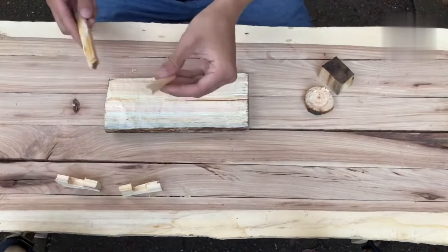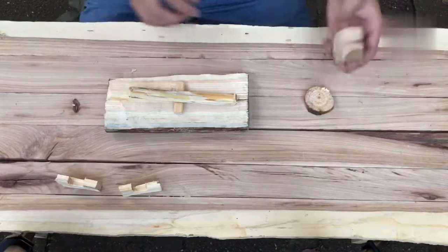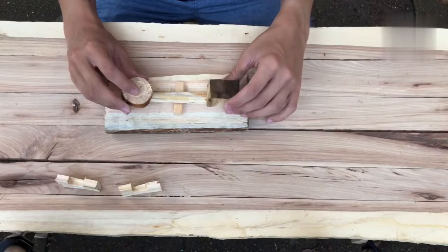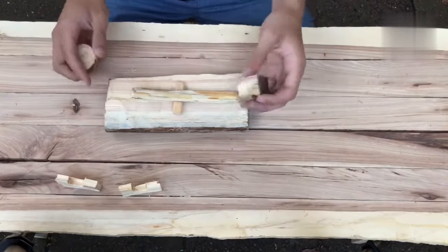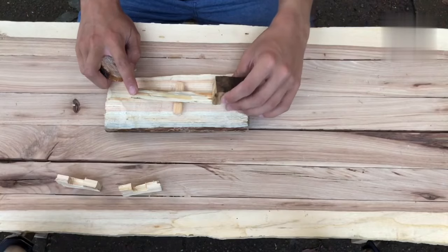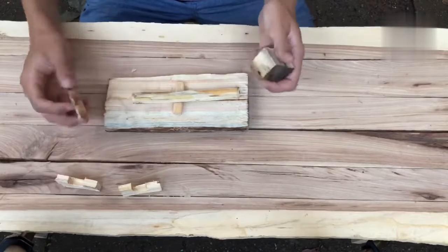Your little circular part goes underneath this to make somewhat like a seesaw. Your block goes on one end, and the little disc goes on the other. That's why I said this isn't too important. Whatever you want, this block is just a counterweight, so that when you push this side, the other side goes back down. And the circle is just where you'll put your finger. So you can really use any shape.